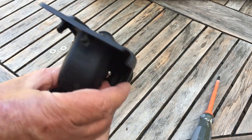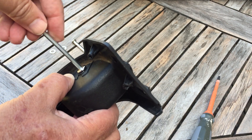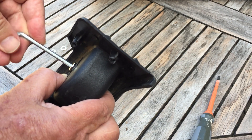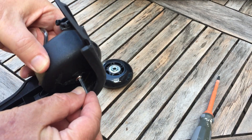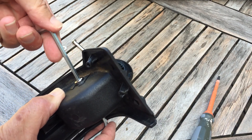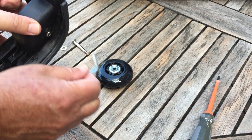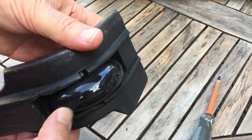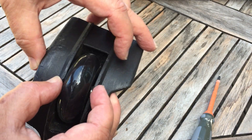Keep a finger on one end to stop it rotating and tighten the shaft up. When it gets to the point where it spins no matter how much pressure you apply, put the other allen key in on the opposite side, hold that one steady, and just tighten the shaft. Don't go ridiculously tight — we don't want to crush the housing — but it will lock over time with the thread lock. You don't want it too loose or too tight.